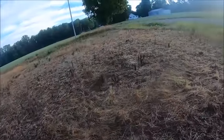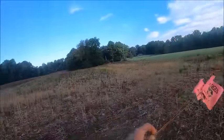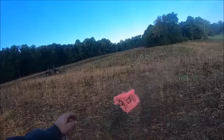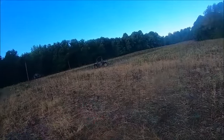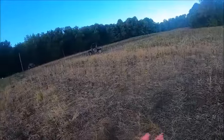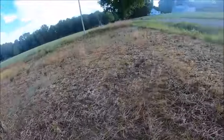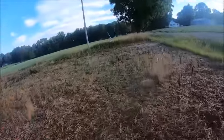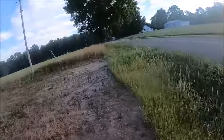Anyway, when I come down here, I'll drop the front bottom and scribe a line across the field. That'll be a reference point, and when my back tire crosses it, that's when I'll drop the plow. That way we're even all the way across the field, which makes it easier to finish, especially since it's going into hay and you want it level.